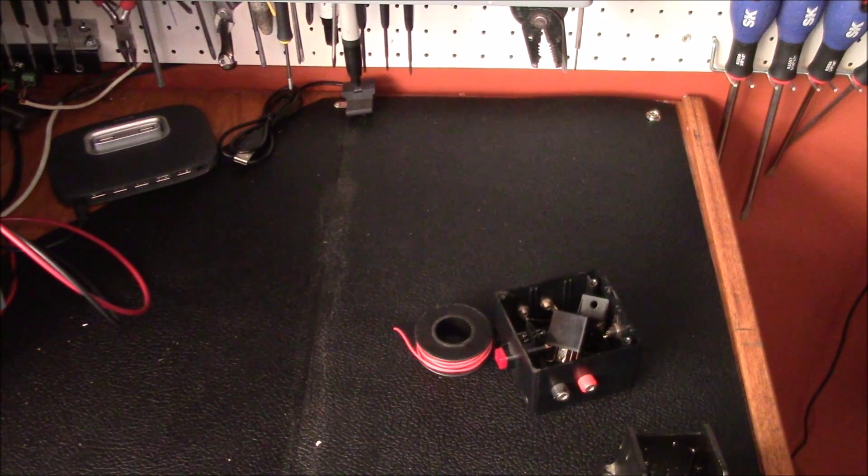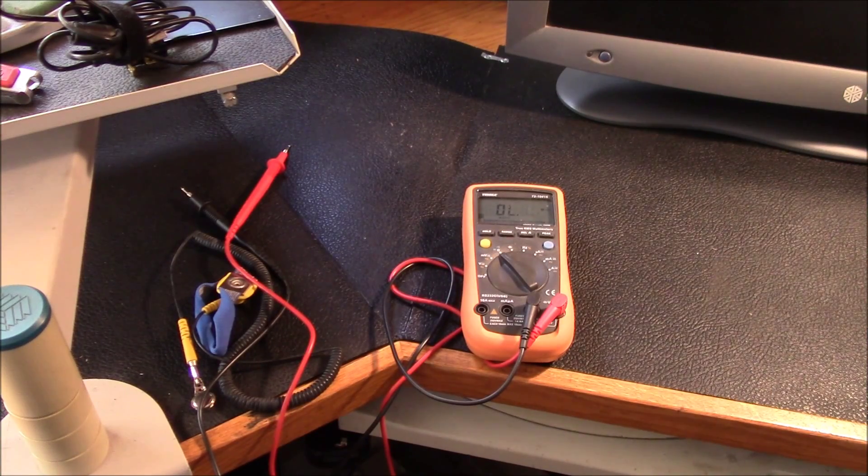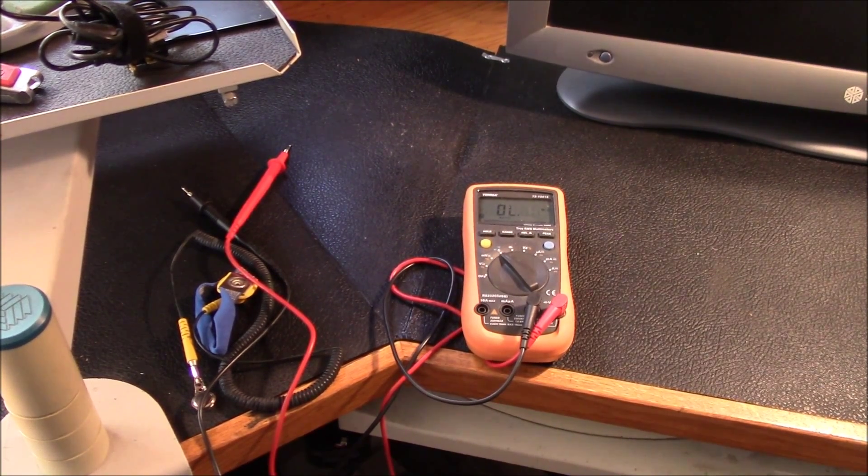I'll have 10-gauge wire for the DC power plus and minus, and then I'll bring over a ground connection from up in the attic — there's a ground wire that was run to the furnace. I'll tie into that ground wire and bring it over via the Romex cable, so I'll have a properly grounded workbench, killing two birds with one stone. With 10/2 Romex I get the hot, neutral, and bare copper ground wire, so I can run one cable and get both power and ground. That's next on the list — be sure to rate, comment, share, and subscribe for updates, and thanks for watching.